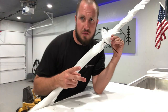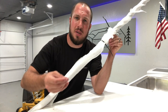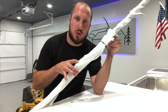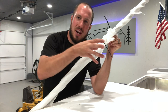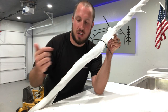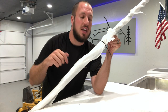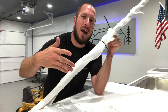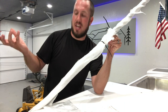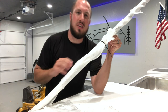Two things I've learned: you want to wrap that cheesecloth a little loosely so the sludge and effluent can move through and saturate it. If you wrap it too tight, you get a really blurry line when you pull it out. I've also kept the tails on my zip ties so when you pull it out of the tank, you can clip them with diagonal cutters. Then use a trash bag — stand the stick up in the bag, open the mouth up, and slide the cheesecloth off the conduit. That easy.